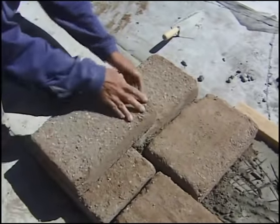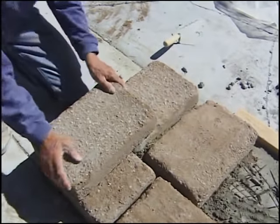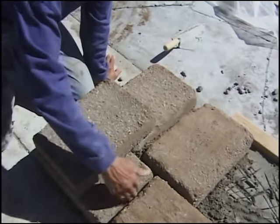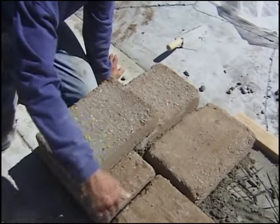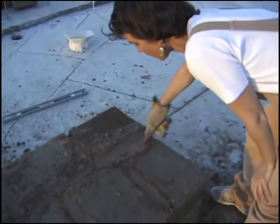We'll have this course running up on top of the seam here, and this gives us a four-inch overlap which is required by code. As you can see, the gap between each adobe is about one finger in width, and we'll fill this first course with cement mortar. Every course from now on will be put on with mud mortar instead of cement mortar.